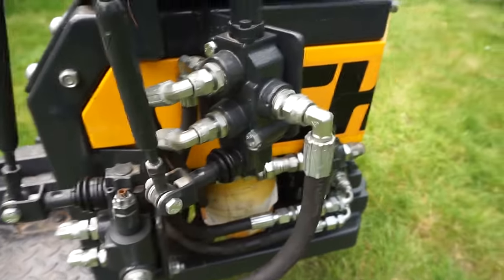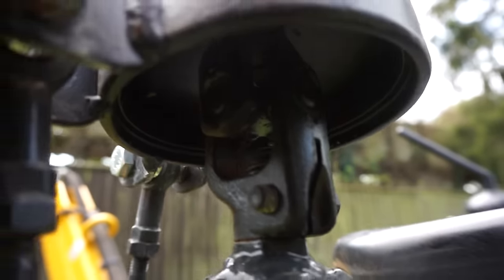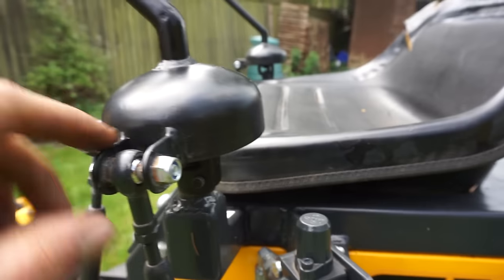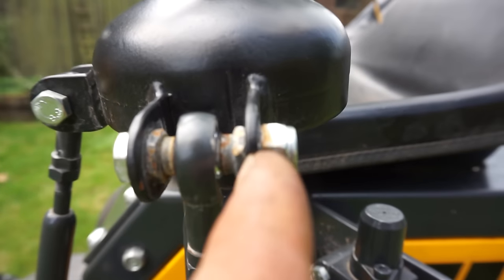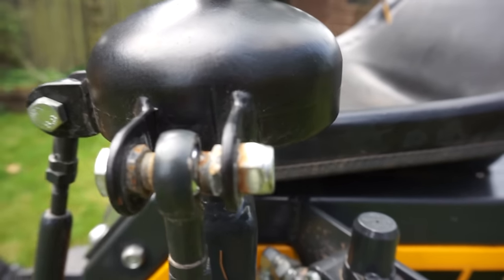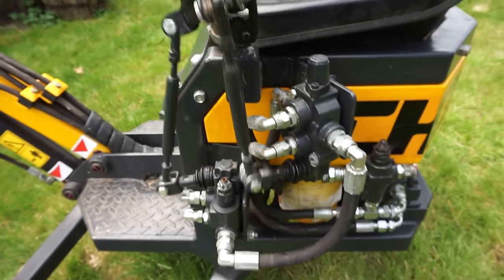The log splitter valves, got two on each side, and I've jigged them up to work on a bit of a joystick there. And I've got a UJ, I don't know if you can see that in the dark there. Ooh, a steering UJ off a Polaris Ranger, one of those buggy things. And then a hydraulic accumulator off a loader or something, I think that was. And I cut it in half and used it as a top. Welded these little tabs on, got these little ball joints here. And I had to turn half the hex off of a nut there to get these joints just to turn a little bit more. See, they're right on the limit there, sort of thing, but that actually worked out not too bad, and they worked the little valvey things, just like that.